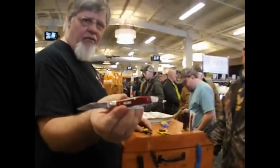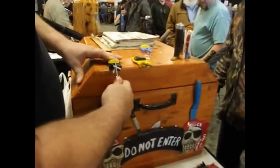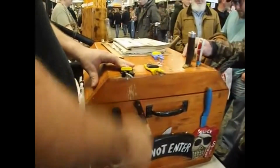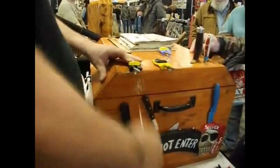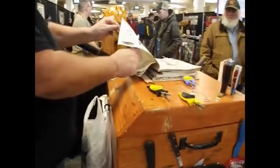Another Case knife. We're going to sharpen a Case knife. Made in America, that's why. Squeeze them in there tight, draw your blade through. You keep the pressure on them. My rods are made to adjust so they pick up the original edge. You're not tearing any metal off the blade. Yeah, you'll take them back into shaving sharp.